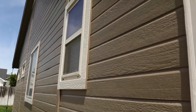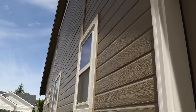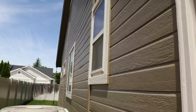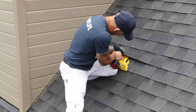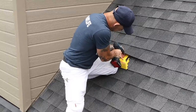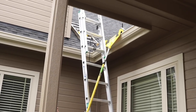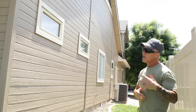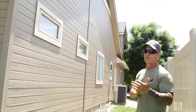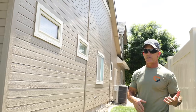There's another high side up here with shakes and dormers requiring some unusual equipment. Pivot makes some great tools — the roof is extremely steep and difficult to get on. I use the Pivot roof boot and a Pivot gutter guard to lean my ladders on the gutters and get on the roof. Once those roof boots are installed properly with an extension ladder hooked in, it's very comfortable walking on the roof.